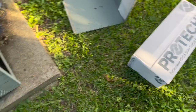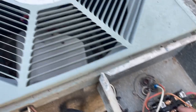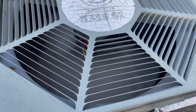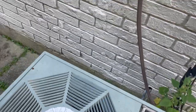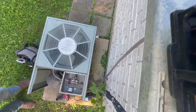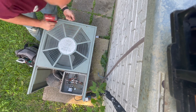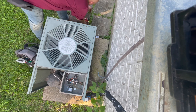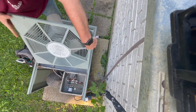I'm thinking the only other thing it can be is the blade. I've got an OEM blade here. I'm gonna pop the cover off that contactor and let y'all listen to it. This is a new contactor that I put on too. It's got to be something with the blade, because there's no way I hit two bad motors in a row. So let's pop it off and change the blade and hopefully that'll solve the problem.